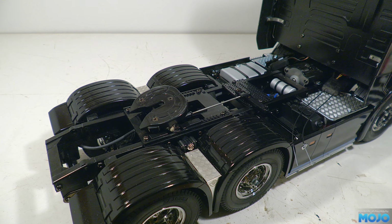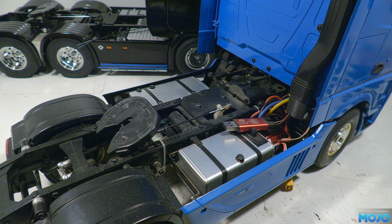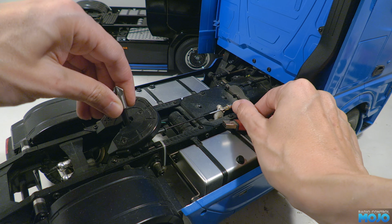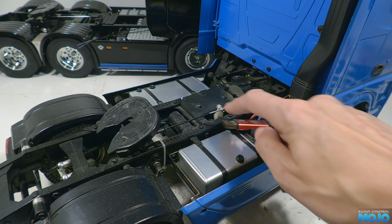Now, I always thought Tamiya really want you to buy the motorised trailer leg kit and fit the plate with a standard size servo to the chassis, but it's a pretty ugly looking setup. A while ago I designed a replacement that looks a little bit neater and uses a Hitec HS-81 mini servo. It still allows the latch to open when attaching a trailer using some model aircraft linkage parts, but we still have the servo arm poking out, so it's not ideal.